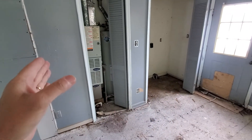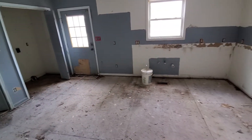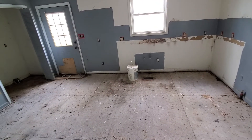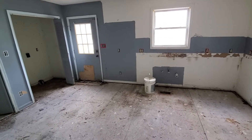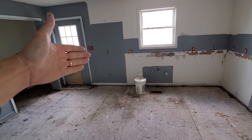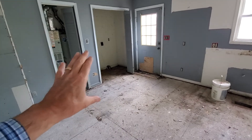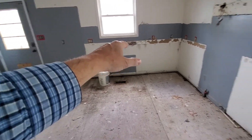The wall will go over to right about where the end of that door stops, so essentially what we'll have is a U-shaped kitchen. We don't really have room to put the refrigerator where it was because we have to move it to the left to make room for a dishwasher beside the sink. That would put the refrigerator in front of our switches — you can pull it out three or four inches and reach behind, but that's kind of janky. So we're bringing a wall out from right there where those switches are to create a U-shaped kitchen, with the refrigerator going in first.